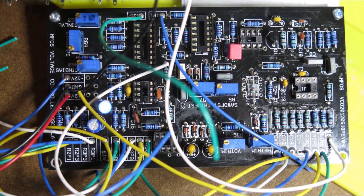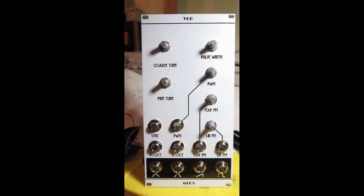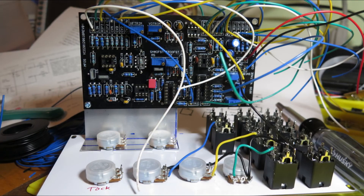Next came the wiring. Wires were soldered to the main board, then jacks and pots were mounted on the front panel — an FR4 PC board panel that was custom designed and fabricated. A bracket was cut and bent from sheet aluminum; one side goes between the panel and two of the pots, the other attaches to the main PCB using spacers. Three attenuator pots were added to the panel — not in Wilson's design — one each for the exponential FM, linear FM, and pulse width modulation jacks. These go between the jack and PCB with the third terminal to ground. The panel has a ground plane in contact with all jacks, so no individual ground wires were needed for the ten jacks.